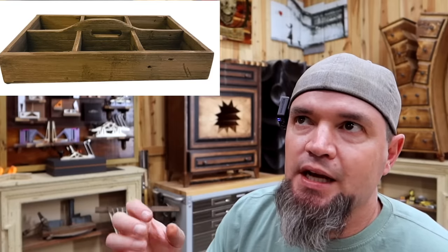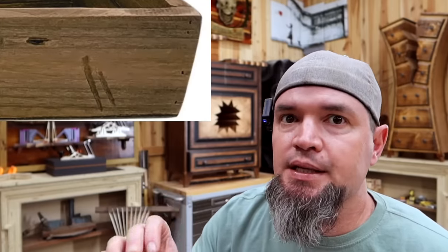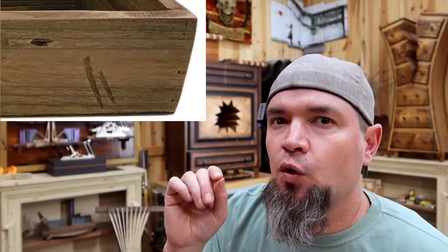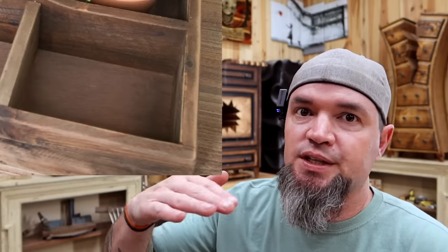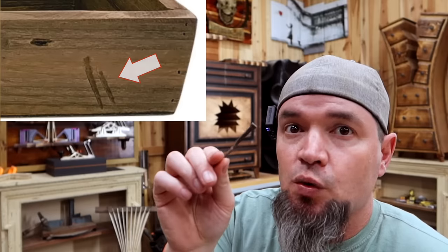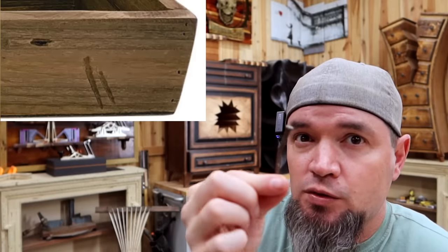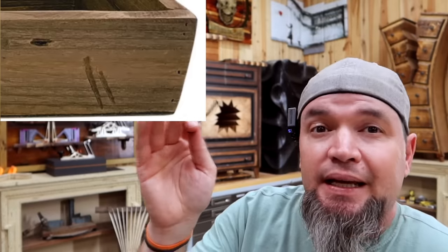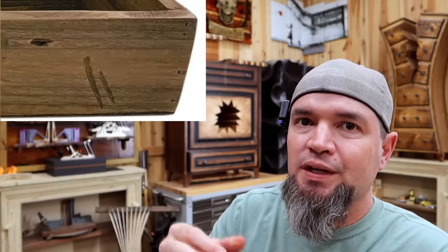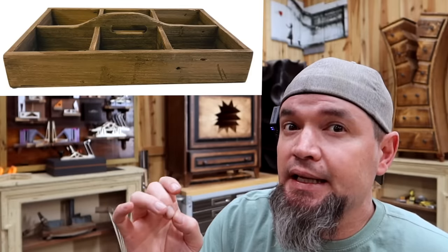If you look really close, this was put together cheaply — brad nails and glue, that's it for the ends and inside dividers. What I don't like is the quarter-inch plywood bottom; if it gets wet it'll fall apart. If you have extra pallet wood, just use the same slats for the bottom and keep everything looking vintage. For those two slats that look like old square nail marks, I actually use this exact technique — keep old square nails or buy a horseshoe/square-cut nail, lay it on the wood, hit it with a hammer, and it makes the wood look stacked and reused.